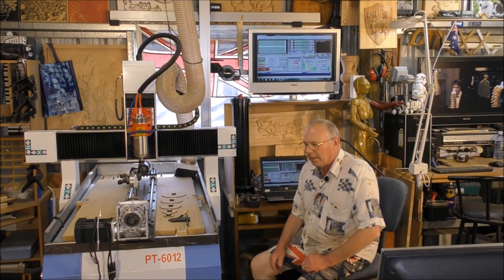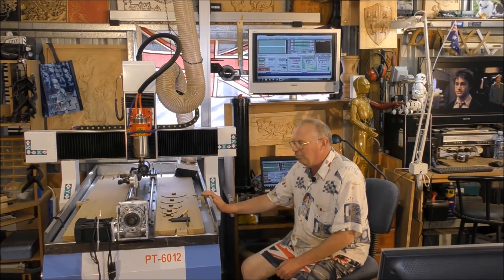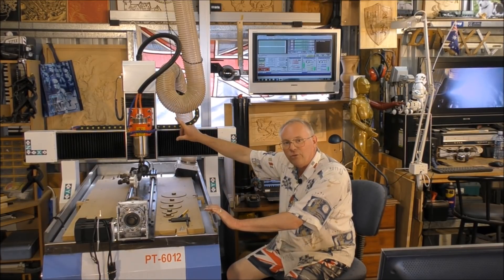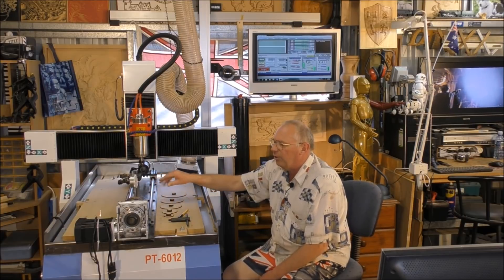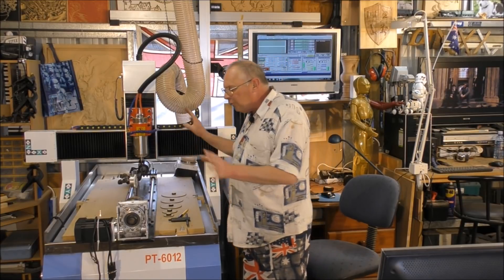Hello and welcome to my workshop. This video has come about through many people inquiring about the 4th axis on CNC machines in general, and in particular the 4th axis with servo drive motors. This is a 6012 fully specced with servo motors, extended Z axis and Z travel, coolant system, the 4th axis with servo drives, a 2.2 kilowatt spindle, and the additional dust extraction unit. So this particular model is fully opted.